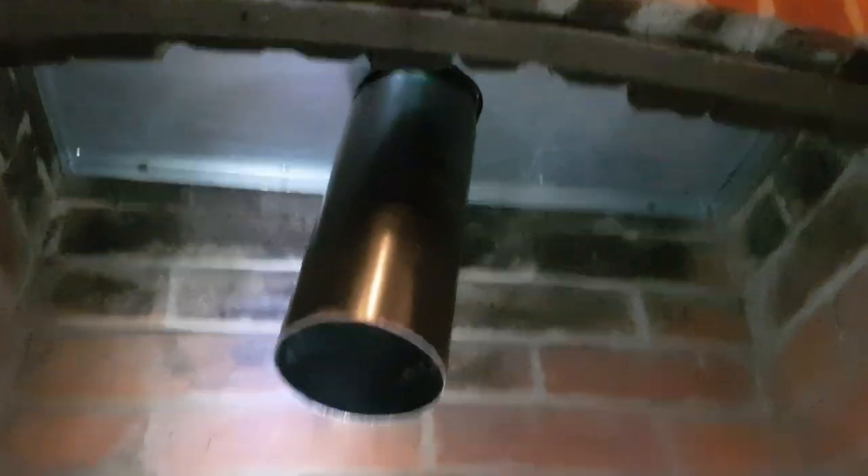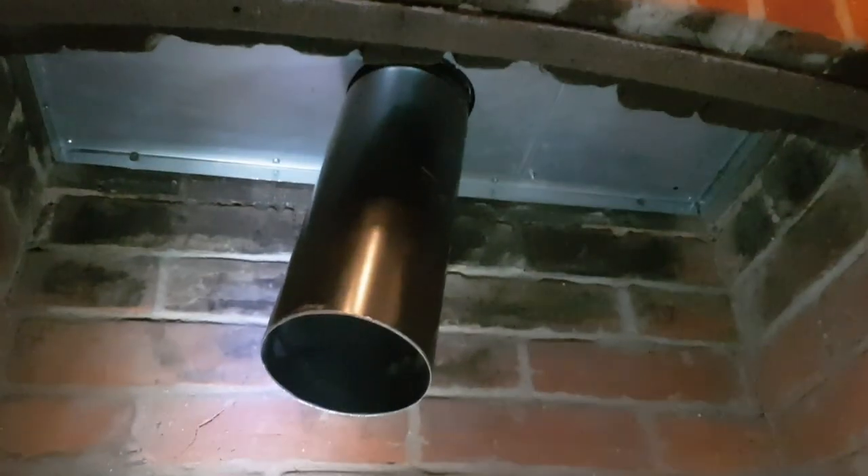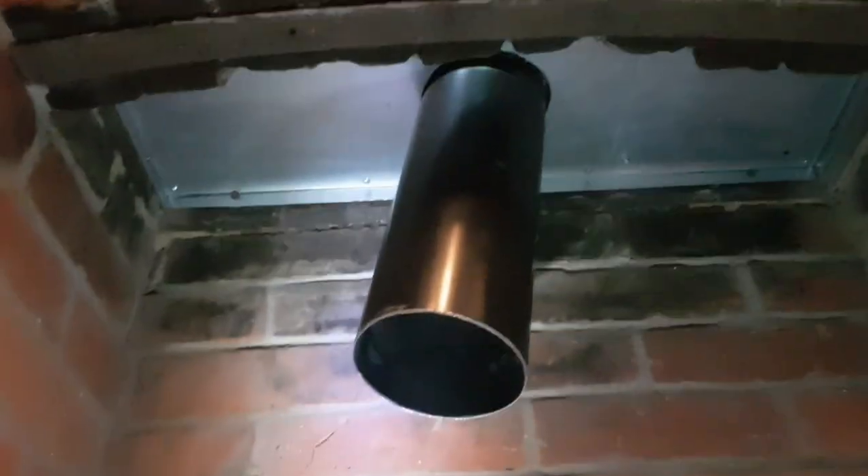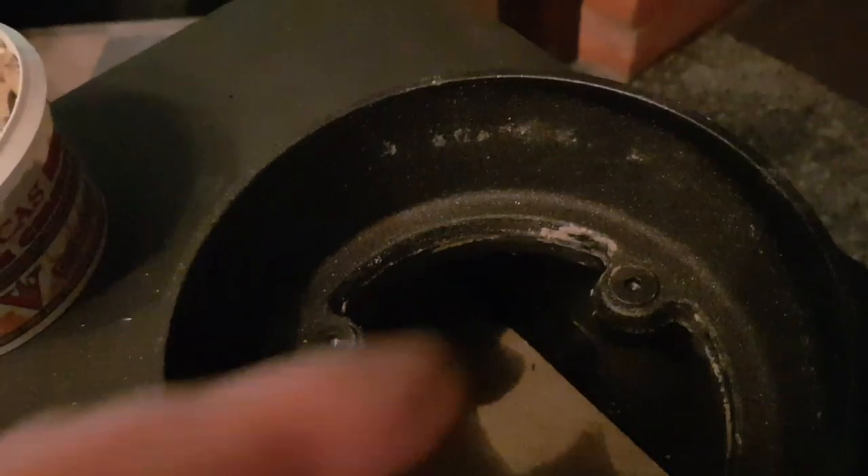All I've got to do now is push the pipe up, push the stove in, pull the pipe down and seal it into the stove. Registry plate back up. Stove collar on, Allen-keyed down — it's got fire rope and fire cement in there, and it's tightened down really nicely and all squeezed out. I just smeared off what I didn't need. Now we just need to feed that into that pipe and seal that one.